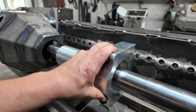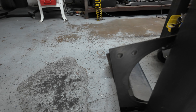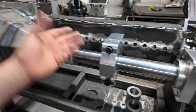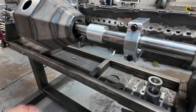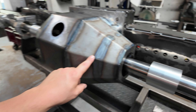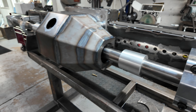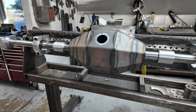The other cool thing is we machined these clamps and started playing with how much preload we needed to put in the housing. We ended up at an eighth of an inch — we were shimming the whole face of it, pulling the housing forward, putting the back braces on to get a little tension. So I just machined these clamps an eighth of an inch shorter. Now we just have a horseshoe-looking spacer that slides under there. You put the tubes in, build the center first, then put the tubes in, clamp it back down without that horseshoe spacer — that puts preload in it. Weld the back brace on, slide the bar through, put the ends on, and voila.